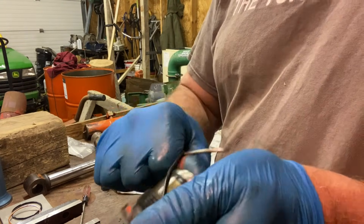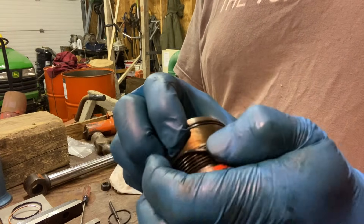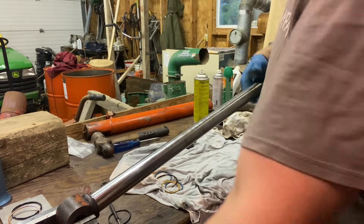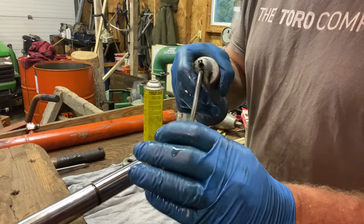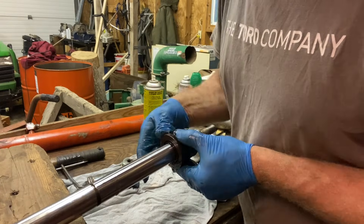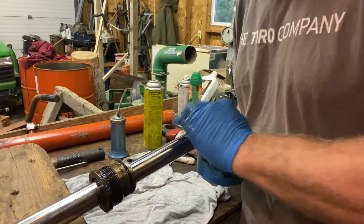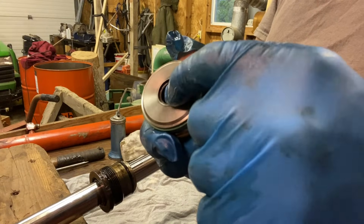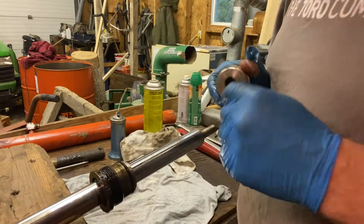We'll change the cap o-ring. Get the cap and throw some hydraulic oil on all the sealing surfaces. When you push it in, gently turn and it should slide on. There is an o-ring that goes on here — right here there's a little groove that matches up with the o-ring. This side doesn't have it, so it's important to make sure that little space goes towards the o-ring.